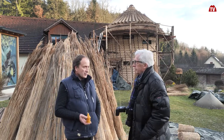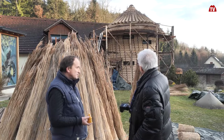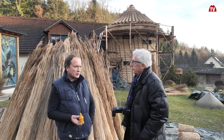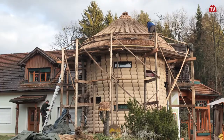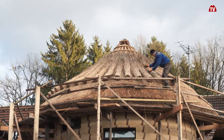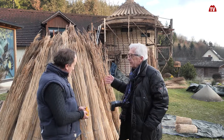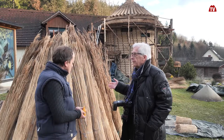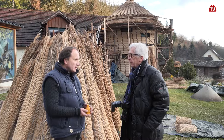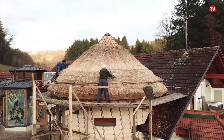What is inside? On the ground floor there is a sales room and product presentation, and above on the first floor a tasting room. The structure is built to look as if it were made of straw — traditional beehives were woven and bound from straw hundreds of years ago, and to keep it authentic we built the large beehive in a round form. You have now decided to replace the straw roof with reed. Why reed? It is not native or common here, but with reed we achieve a longer durability and lifespan. It is covered about 36 to 37 centimeters thick, and experts say one centimeter equals one year of lifespan — so you have over 30 years of lifespan with this roof.